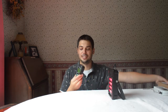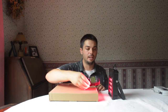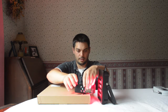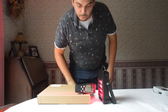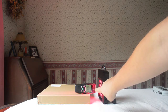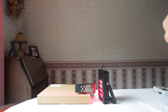Let's do a quick measurement on the intensity using our solar power meter. I'm not a huge fan of this meter for accuracy, but it's good to give you a ballpark reading. If you zoom in, you can see it's reading 284 — so 284 watts per meter squared. When you convert that to milliwatts per centimeter squared, you're getting 28 milliwatts per centimeter squared.